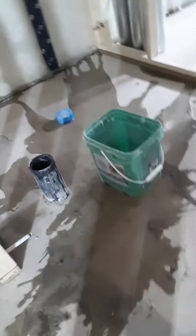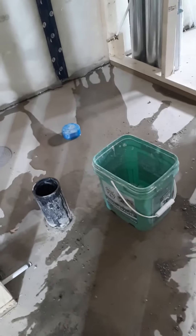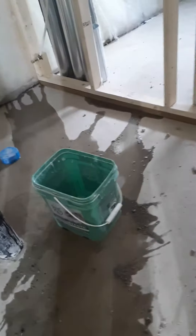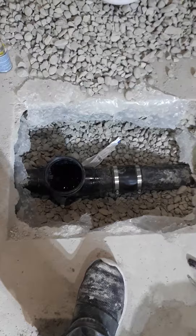So right here it's a three-inch even though it starts with a four-inch trunk — that means that once you come down you're diverted. That being said, you have to test the water here to make sure it flows through clean. The water is flowing clean and there is no water inside of here. Pour a nice good bucket of water down there. There's none in the hole — that's the most important part.